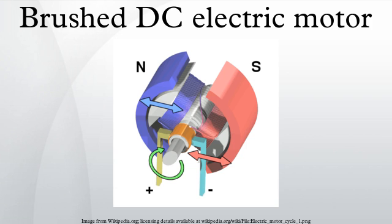In an experiment of this kind made on a motor with separately excited magnets, the following figures were obtained. Apparently, if the motor had been helped on to run at 261.5 revolutions per minute, the current would have been reduced to zero. In the last result obtained, the current of 5.1 amperes was absorbed in driving the armature against its own friction at the speed of 195 revolutions per minute.